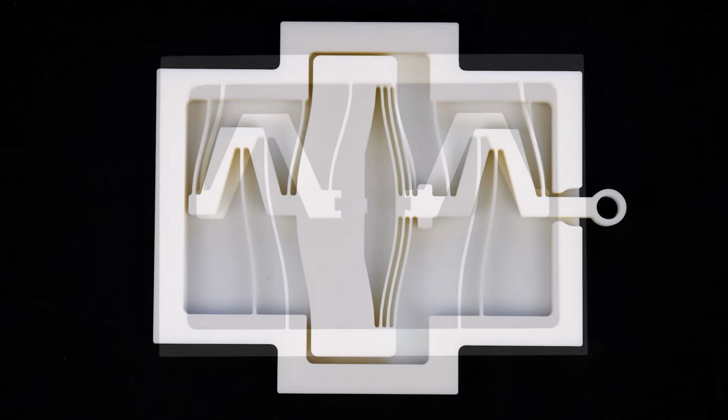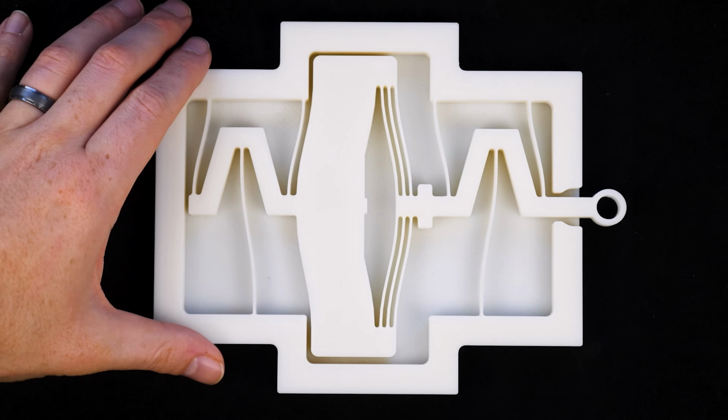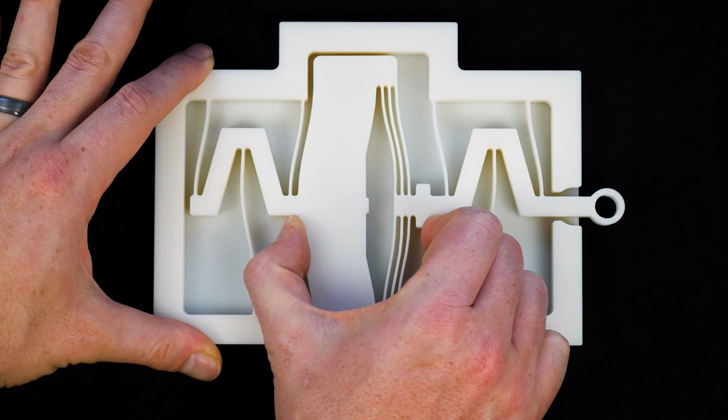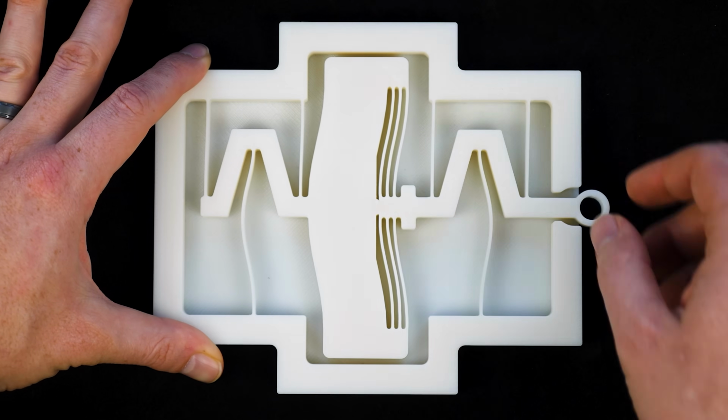Thus, if a bistable mechanism is then used to replace the long and short bars, the mechanism can be switched to either achieve the stiff or compliant force displacement plots as desired.